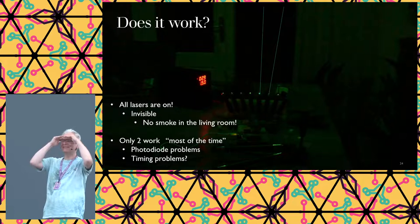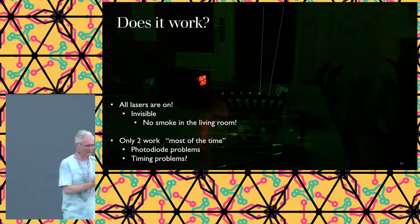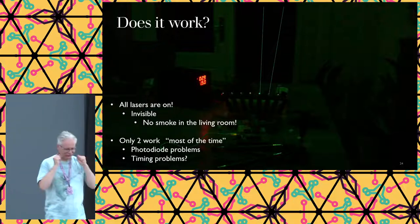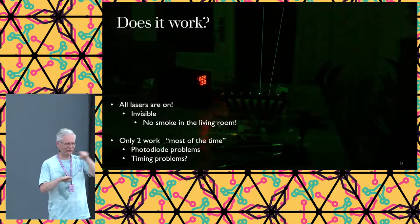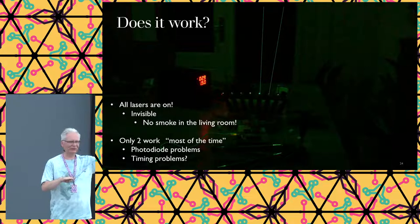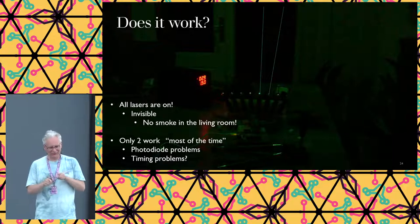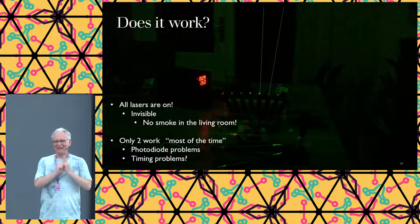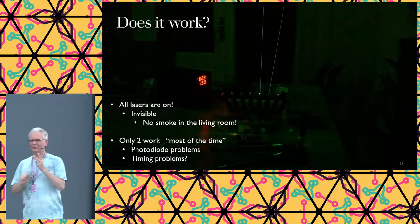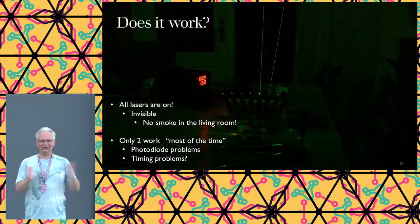So let's talk about time of flight. Conceptually, what I think happens, and that's the stupid mistake we did at the beginning, we did check whether if you power a laser that it would immediately just go on and keep burning. What we didn't check is how much time it takes between actually enabling it and the first light coming on. I think that I have only two lasers that are reasonably fast and the rest is too slow. So my detection is off.